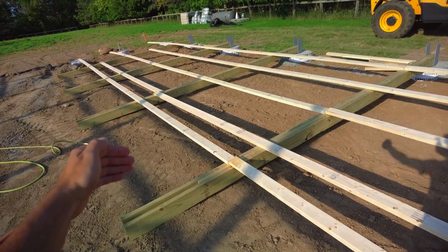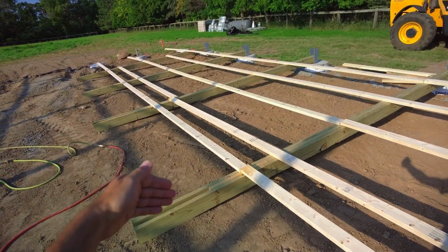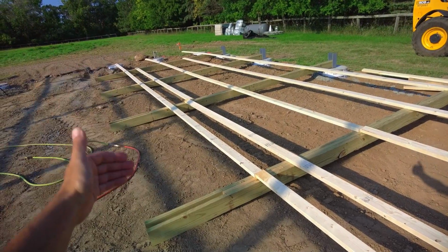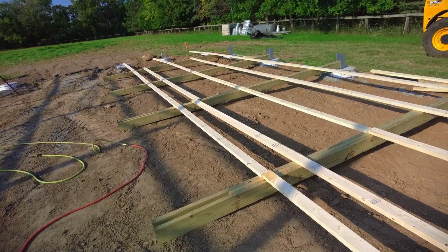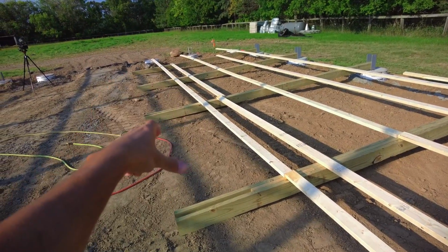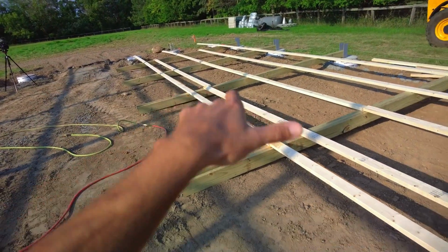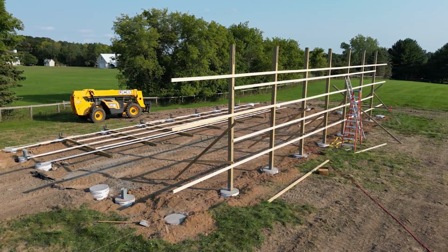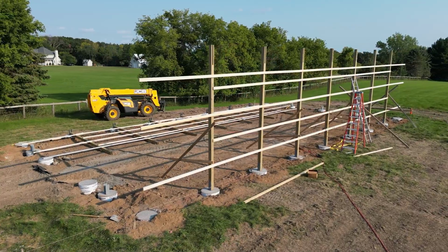With the drop-in purlins, they're kind of more like joists into hangers, so they're only as long as the space between the 2 posts, and those are all going to be pre-cut. So ideally, every one of these spaces up here where the trusses are, where those purlins are going to be, need to be exactly the same. So that's more what we're concerned with.